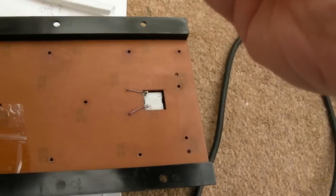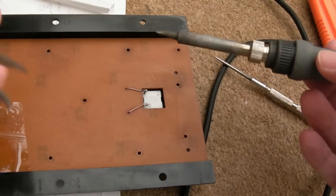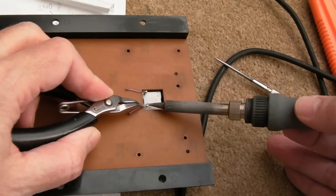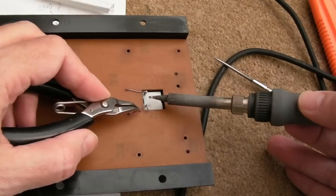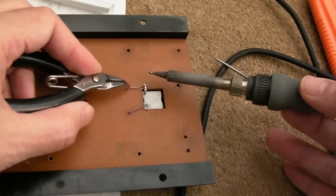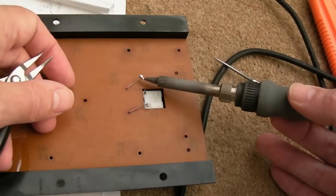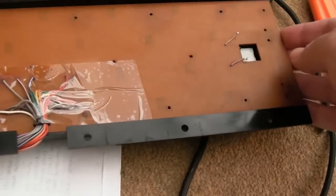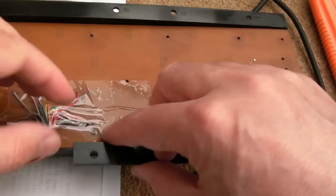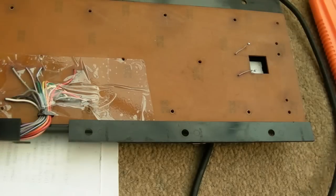This is the caps lock, I think. And yeah, you always need to desolder this, otherwise you can't separate the housing from the PCB. So let's just heat. Hopefully it's not wrapped around now, it's just hold on there, look. Separate that. God, that stinks. Let's try to lift it up a bit off the PCB there, and then clean the solder. There we go. Right, I think that's all the screws out. Is it? Is there a covert one? There's a covert one here, look. There we go. Right, that should be them all.